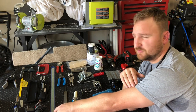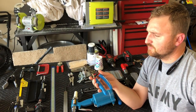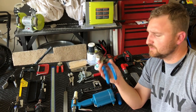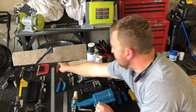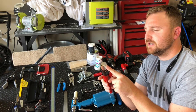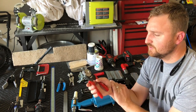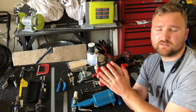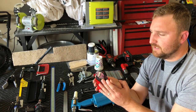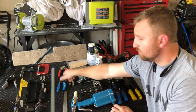For electrical work, you'll need a good wire stripper — don't cut corners on that. You'll also need a crimper for what I believe are D-sub pins. It's spring-action: stick the pin in, squeeze, and it automatically crimps. You will definitely need one of these for the empennage wiring, and it'll come in very handy when you get to the finishing kit.